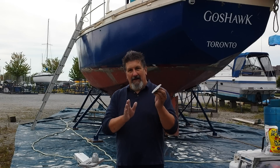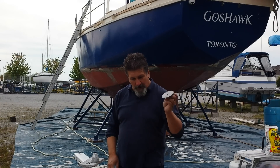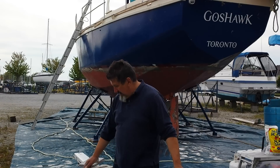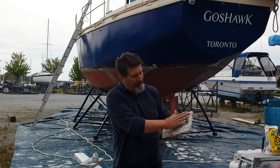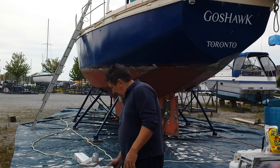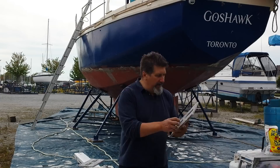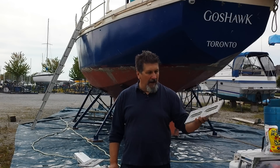You've got to make sure that the aluminum on the anodes is in contact with the steel of the boat. After painting the bottom, I sanded down the spots where these anodes were going to go and bolted them down as tight as I could. This is one I haven't cleaned up yet. You'll notice there's actually a powdery, chalky substance on them — I think this is just aluminum oxide. You can see that it's actually chewed away quite a bit at the anode. I suspect I've probably lost between 5% and 10% of the metal, which is good — at least I know they're working — and there's enough left that I think I'm good for at least another 3 or 4 years.